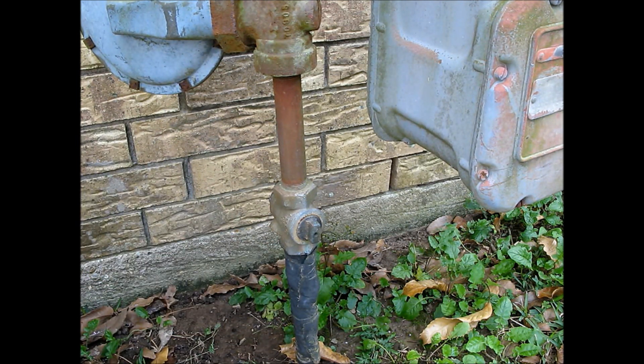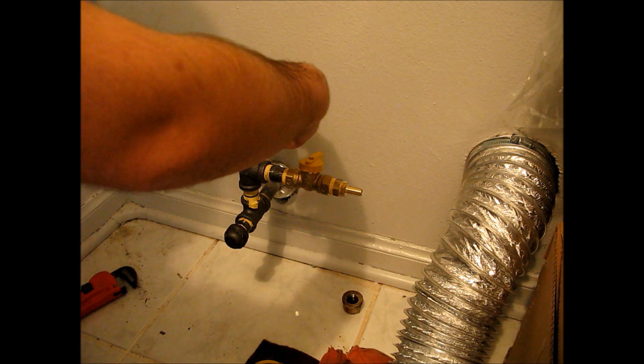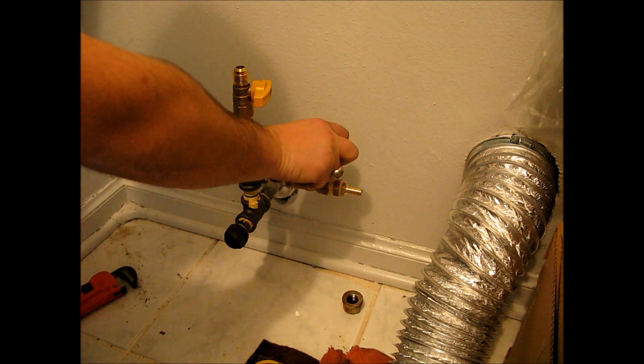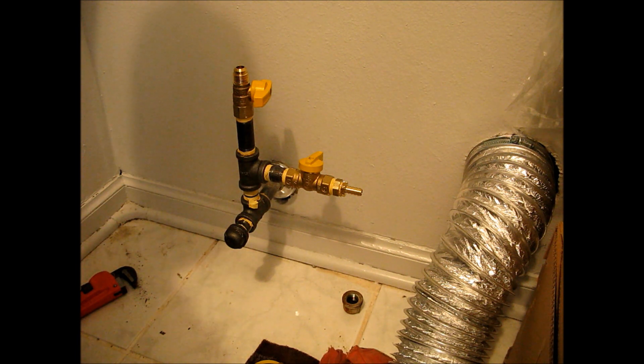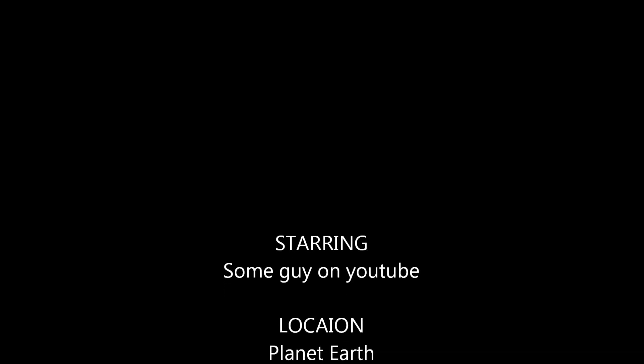Alright, gas is back on. Let's go check to make sure there are no leaks. It appears there are no leaks — I don't smell any odor or hear any hissing. We've got gas at the dryer valve and gas at the generator valve, so it looks like we did a pretty good job. The last thing I want to mention is that I need to remember to go relight all the pilot lights for my gas appliances such as my furnace, hot water heater, and dryer. Anyway, that's all I got for you guys. Hope you enjoyed!